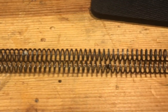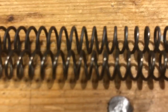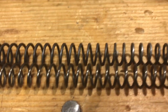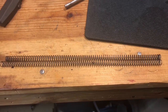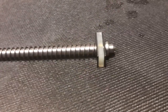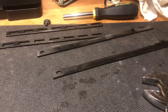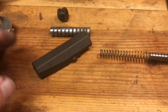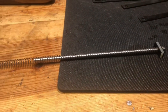Here's the difference between the old spring on top and the new spring on the bottom — the new spring is about three-eighths of an inch longer. It looks like the same number of coils, but the new coils are a tiny bit thicker, which will help with tension. I do expect this to have a little more forward force when closing the bolt, and that might have been part of the problem. Here's my new spring and guide rod assembly with the new buffer sandwiched in. We're going to do a nice wipe-down cleaning of the side rails, spacers, and knock any residue out of the gas block — though I didn't see a lot, so it doesn't appear to be overly dirty.